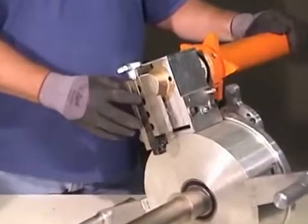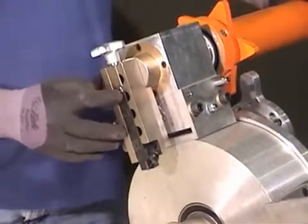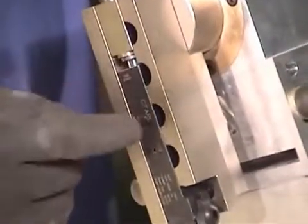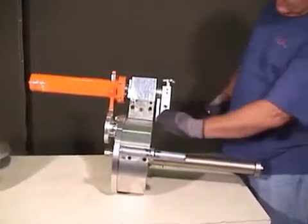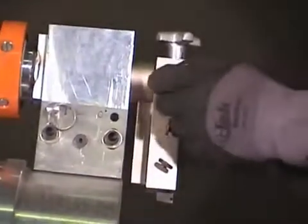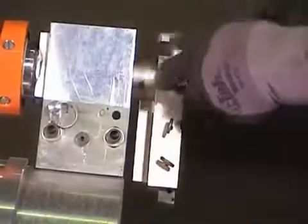First, make sure the cutting head is adjusted properly to the size of the pipe you will taper or scarf. Here you have 8 inch through 16 inch settings. To adjust the head, you must first loosen the thumb screws. Loosen the 2 set screws. Remove the cutting head, being careful not to damage the cutting blade.